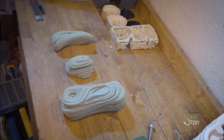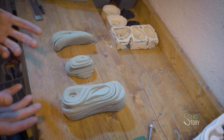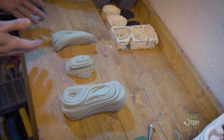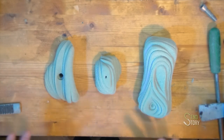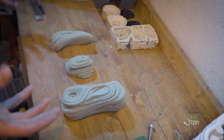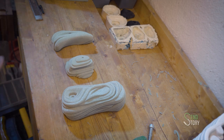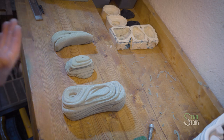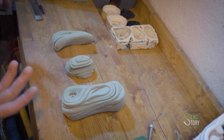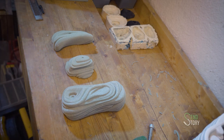Here you can see all three shapes — they turned out pretty close to how I wanted. The one on the far right is a little more organic and intricate than the original hold, and the latest hold is somewhere in the middle, so I have this gradient of aesthetics but they all feel part of the same family. I'm going to use a drill press to drill the bolt holes so they're perfectly perpendicular to the back of the hold and to the climbing wall, which means minimal cleanup after casting. I'll also show how you can do it without a drill press, since that's definitely not necessary.